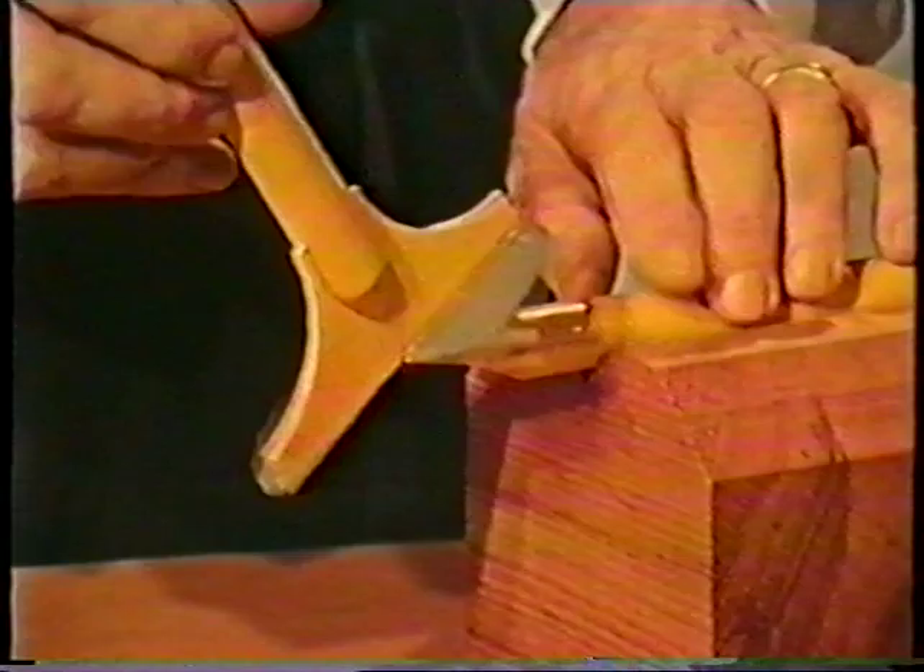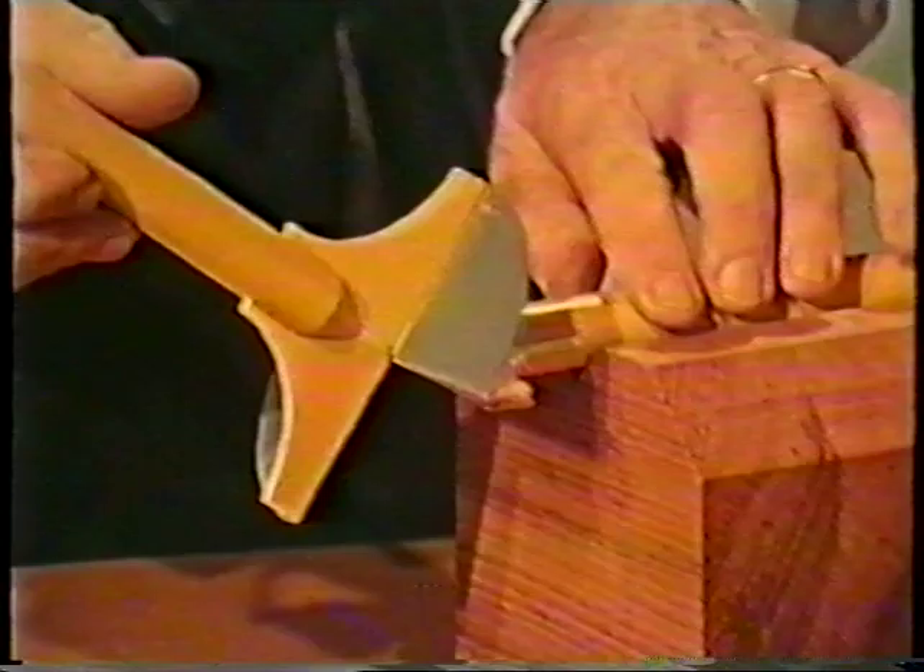Because this plane wobbles, it is not a plane of symmetry. The theory shows that there must be a plane of symmetry that never wobbles at all, if a coupling is to transmit exactly uniform speed between the shafts without any fluctuation whatever.